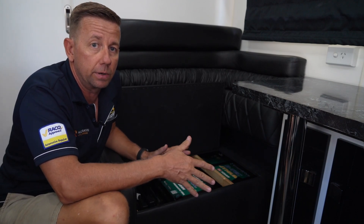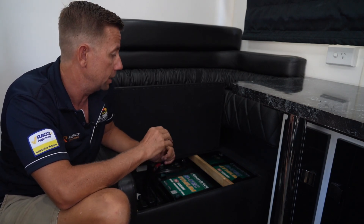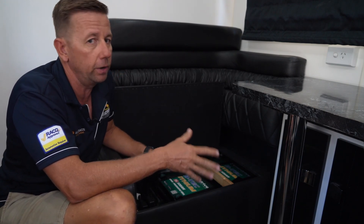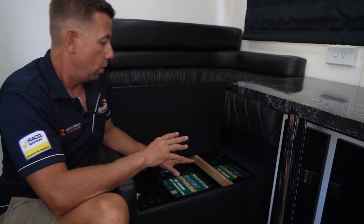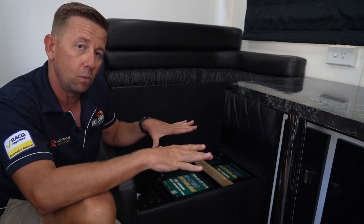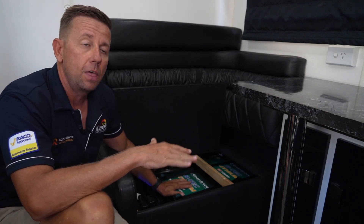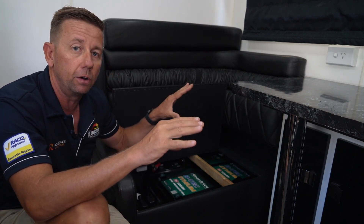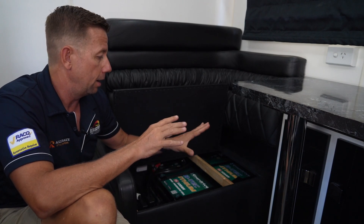At the moment, the 300 amp battery is as big as we can get — I'd bet we'll see that change in the future. So if we want a system this size, 600 amps, the best solution is two 300s. Three 200s — I've tried it personally and it starts to get a bit out of whack after a while. So two 300s is the way to go. Also, the 300s are fantastic because the battery is full of cells, and we've got one BMS or battery management system on the top monitoring all the cells. The more cells controlled by each BMS, the better off we are. Lots of reasons to go two 300s over three 200s.